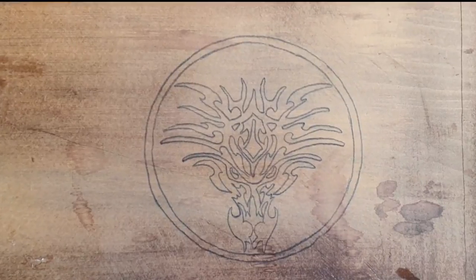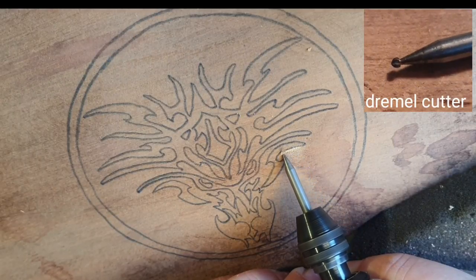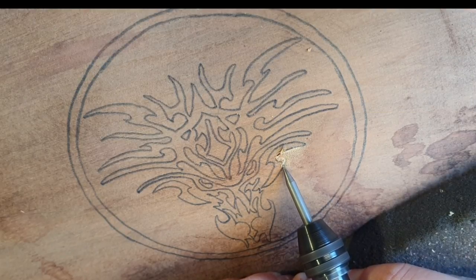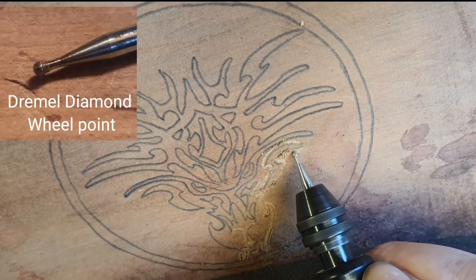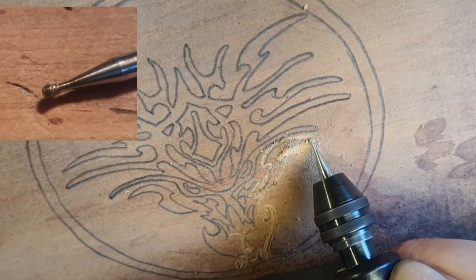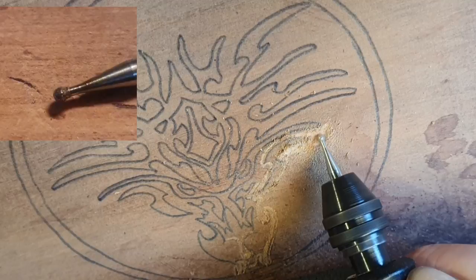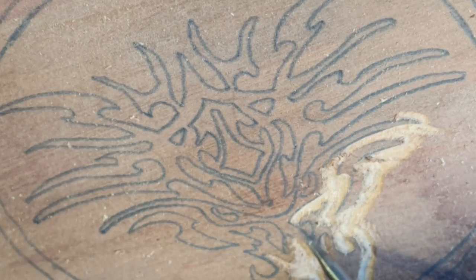I spared you the tedious nature of me tracing somebody else's amazing drawing. I went in with this sort of like cutter here and it was really kind of tearing up the wood, which was working really well, but it sort of just teared up the wood. So I persisted with that for a little bit, and then I went on to the Dremel diamond burr, and pretty much I kind of stuck with this for most of the carving. I went back to that cutter just to get into some real skinny bits in the middle, but really stuck to that diamond burr — it just worked really, really well.